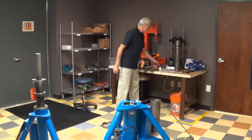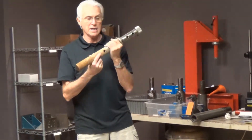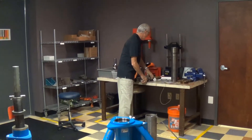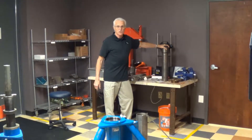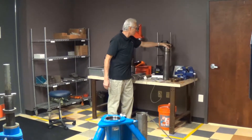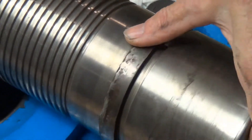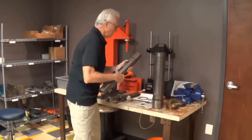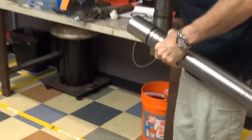When we took it apart, one of the first things we noticed was the top portion of the jack support bar at the very top was pretty much almost rusted in position. It came out, but as you can see from the bottom, a lot of water got into this unit. After further inspection, we found the second stage was leaking very badly — it was probably rusted in place at one time because it hadn't been jacked all the way, water hadn't been evacuated from the system, and the jack had rusted to the point that it pitted and corroded.